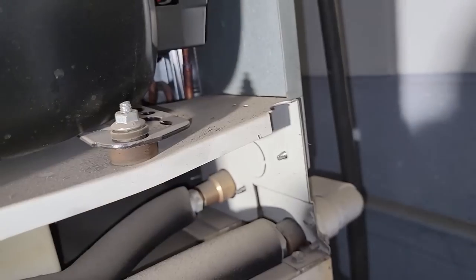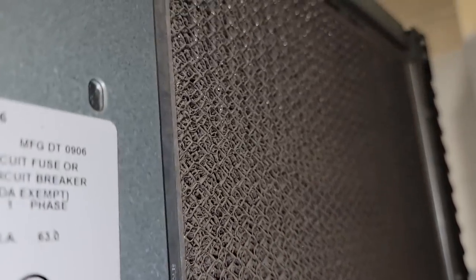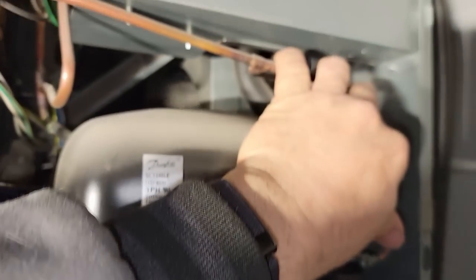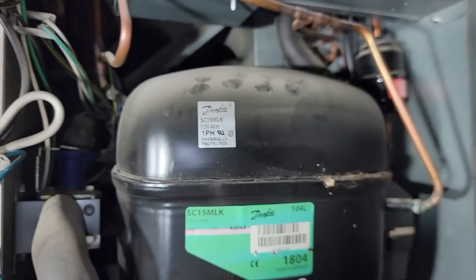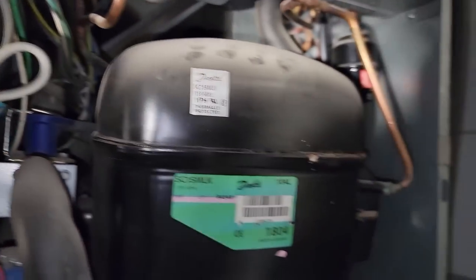The fan looks like it's going a little slow. The air filter — I looked at that earlier — it's a little dirty. Looks like it was last cleaned in '17, so we'll get that cleaned up. Not the warmest air in the world — that's your discharge gas. It's obviously not real super hot; it might be low on refrigerant. You got cold coming back to the compressor. That fan really looks like it's acting up — it might be a fan cycle switch. We've had a lot of those go bad.